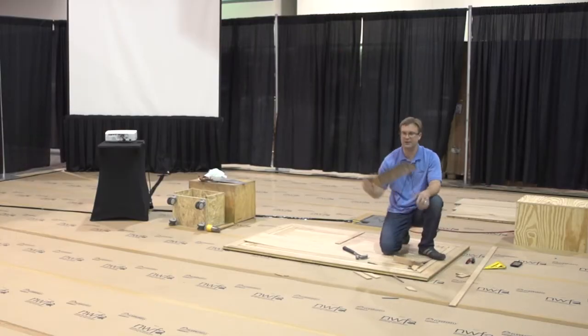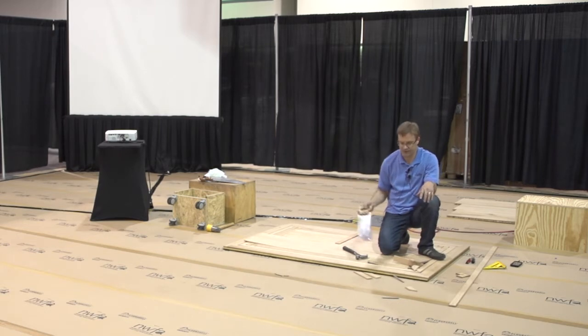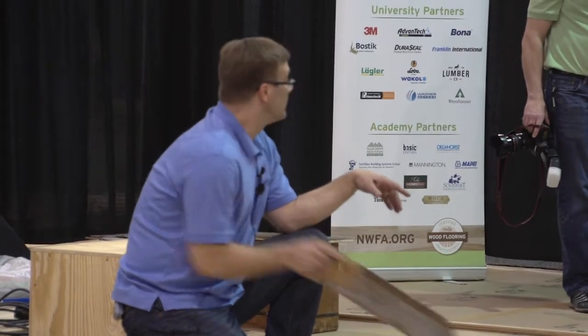You'll notice I've also bucked off the end of my saw. The reason is that if there are walls around here, if it's squared off I can't take much of a swing to get the board started. So you buck off the corner so you can actually get a little more of a swing to get that cut started.